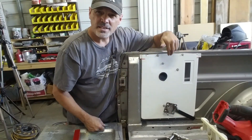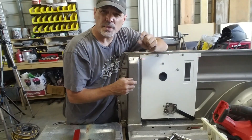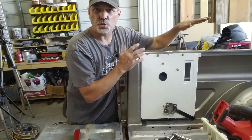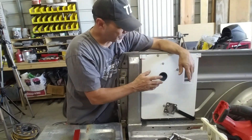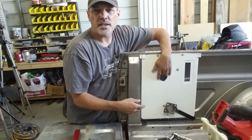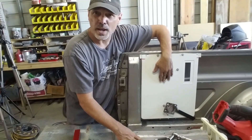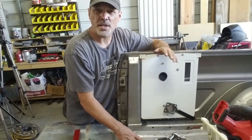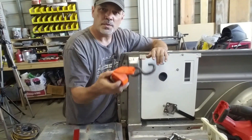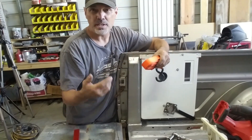I'm going to run this, but I'm going to turn the mic down because this actual drill is a 12-volt Harbor Freight special cordless drill — it's a three-eighths impact. I really needed a regular drill; I just grabbed the first one I saw that was 12-volt cordless because the truck's 12-volt and I want to wire it to the truck. I just ran a hot wire to the battery, ground to the frame, and we've got a circuit as long as I pull the trigger. Since it's an impact, it's going to hammer. Sometimes I can get a spin without it hammering; sometimes it just sits there and hammers for a while. Nevertheless, it does make it so I can hold on to the strap and it doesn't yank it out of my hand — the impact will clutch out. So that kind of helped me in the long run, even though it's noisy.